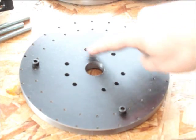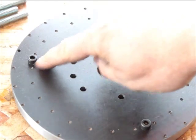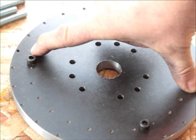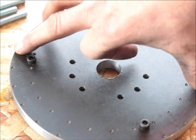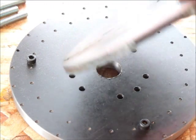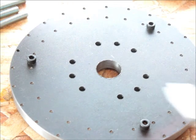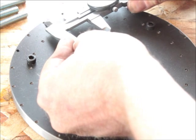And then you have these little notches out here. These notches are set conveniently — that notch is also the same as this, put in between. It's six and a quarter inch diameter. And then out here we are at seven and six hundred and fifty thousandths, which is just where I landed. Because once I cut this out on a plasma torch, I have to hammer off the slag, grind it off, and then machine it down. It comes to right about there.